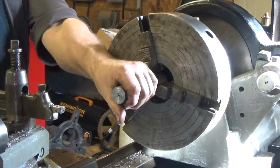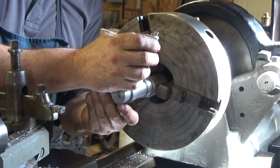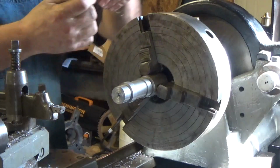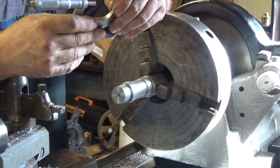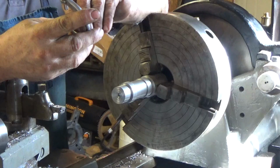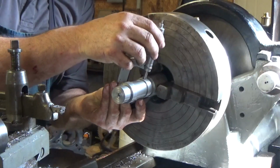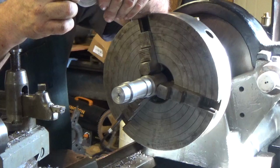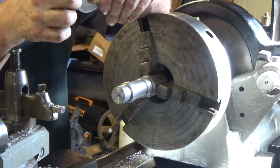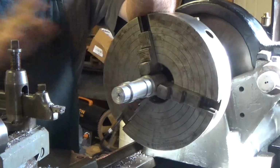So I got you over, and we got the test bar in, and we're going to measure it out. Like I said, I cut these on the Kingston, and right now we're measuring on that front journal, we're at 1 inch, 440, 1, 2, 3, 43 and a half. In the back journal, we're measuring 1 inch, 443 or 42 and 9/10. So we're 4/10 off the bat.